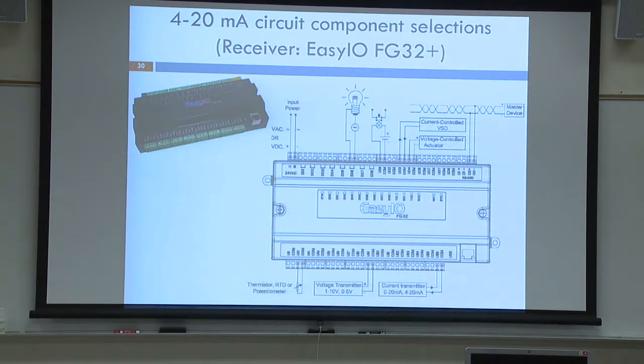You'll notice the circuit will work correctly when you put the resistors in parallel with that input. So you just go between the input and the ground with a 250 ohm resistor. That's another thing we didn't have. We had 560 ohm resistors, so I gave you two. So what are we going to do with those? We're going to put them in parallel. And we're not going to be at 250, but we'll be close, 280 ohms or thereabouts. Close enough to make the circuit work, okay?